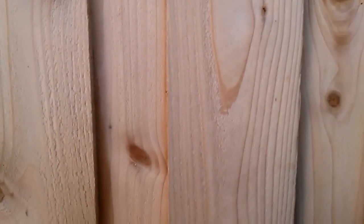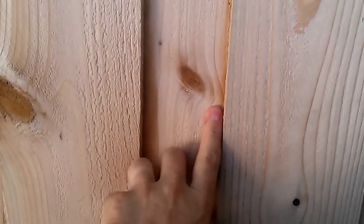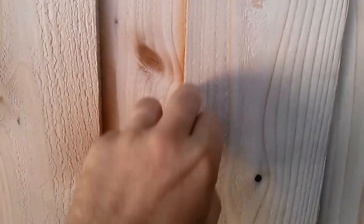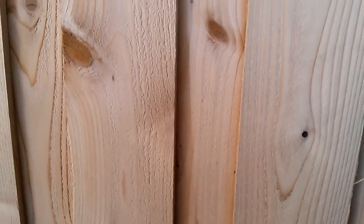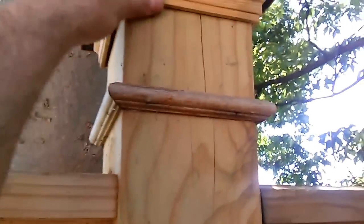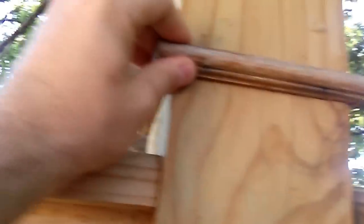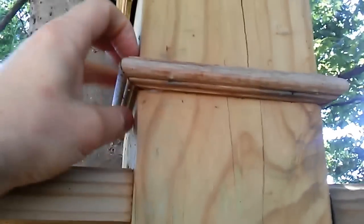There are stainless steel pin nails driven in at a 45-degree angle. The idea is that water comes down and nothing is going to follow the indent of the nail into the meat of the wood and rot it. These caps are just store-bought — about $15 — and I've routed a groove in to put this nice decorative molding.